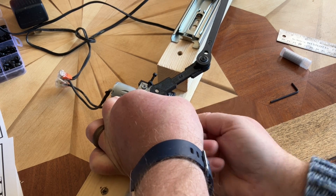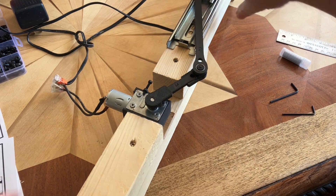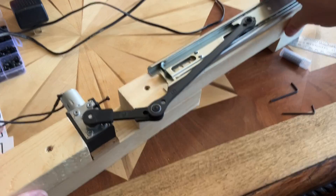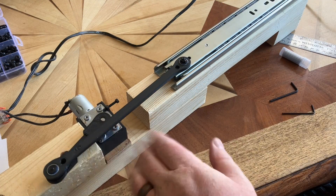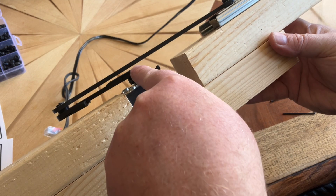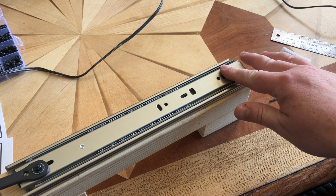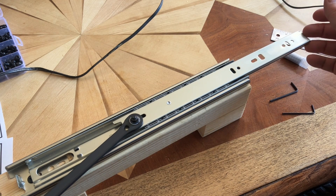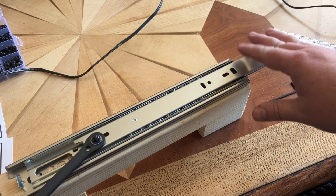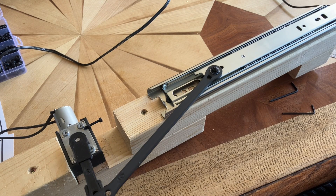I'm doing this live because I want to show you how easy it is to assemble these things once you've got it all together. We're going to take this end shaft point, extend our drawer slide to the point that it goes on, and just slide that over top — and just like that, that is our full mechanism. Now we've plugged it in and you can see how it all slides. You just have to watch this clearance here — these beams have a little bit of bend in them, so make sure you have that clearance when it goes through and hooks up. You can see just how beautifully smooth this mechanism is. When I first tested it on my old design, I was able to get up to a kilogram. It has a bit of a squeak on its return when it's got load-bearing, but it's a beautifully smooth and very easy to assemble animatronic mechanism.